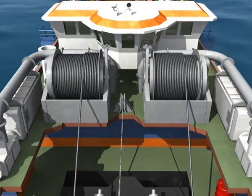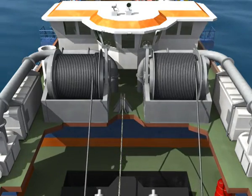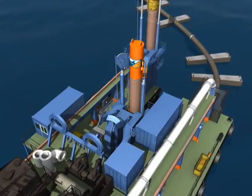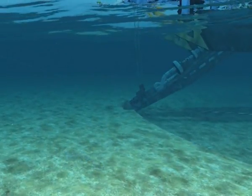By pulling on the side wires, the ladder is moved sideways, swinging around the main spud. At the end of the swing, the dredger is moved forward by moving the main spud in its spud carrier hold backwards, after which the swing is reversed.